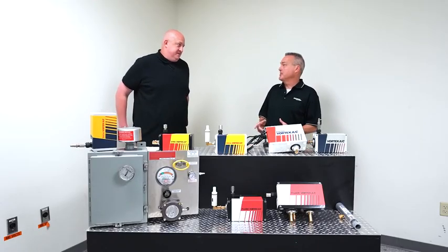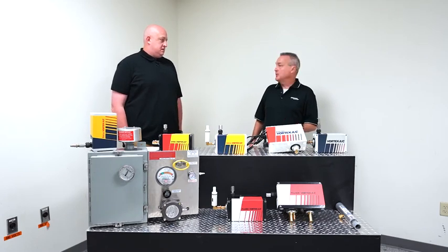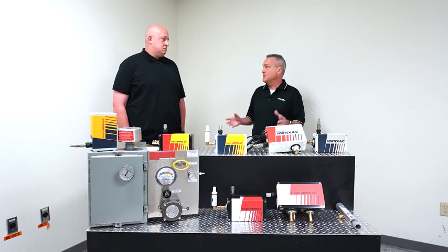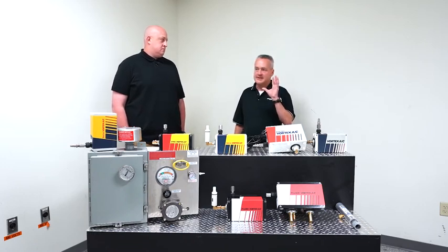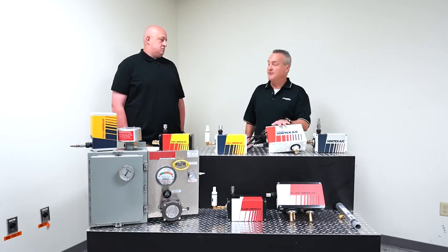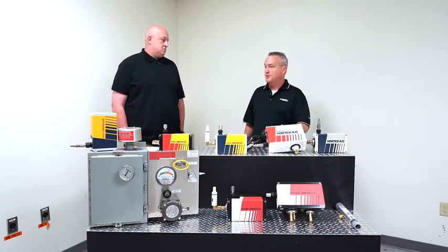So Zach, let's talk a little bit about the NEMA ratings. NEMA 12 is dust tight and drip proof. It would be like a general shop environment where you're not exposed to any water spray or anything. The NEMA 4 would be for applications where your equipment is going to be exposed to water spray. NEMA 4X is basically the same thing, but it's also corrosion resistant.